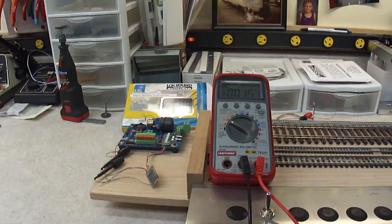From here, set CV6, which is the mid voltage — make that the midpoint between CV5 and CV2. CV2 is the low voltage; basically set that at whatever value makes the motor start turning at speed step 1. It's the same process: start increasing the voltage until the motor moves. The closer to zero you are, the better — you get a better range and the slowest performance possible.